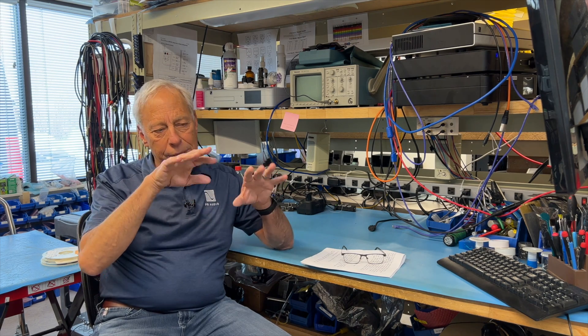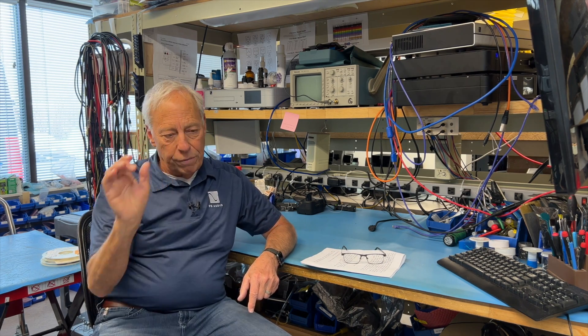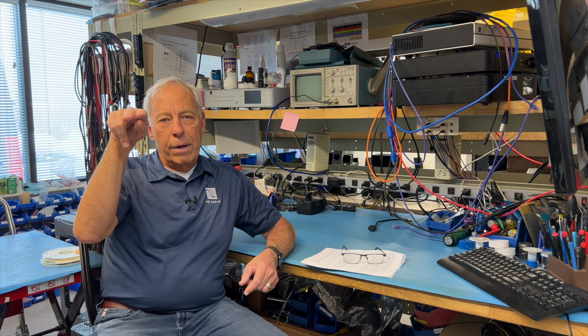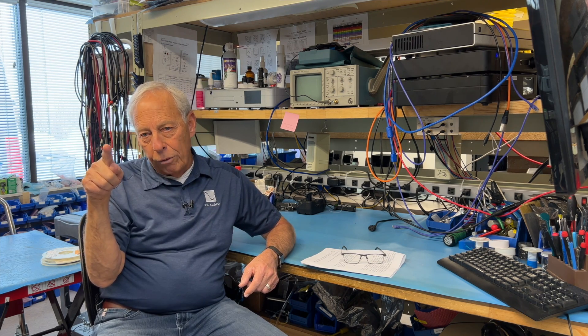You want to filter out noise and little stuff — that's a capacitor across the feedback and a resistor in the feedback network of the op-amp, with reasonably high gain. It's on all the time. Then once something goes above a certain threshold — say 0.01 volts — something that isn't noise, which we've eliminated with the filter, if it rises above that, the output goes positive.